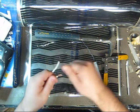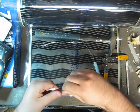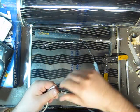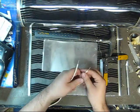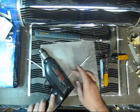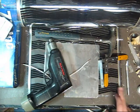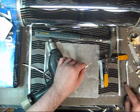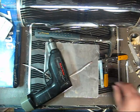I like to just twist it up like this so it all stays together. Something else I like to do is put some solder on these ends already, so once I put it down onto this part it'll stick right away. I'll put some solder on here, and then I just press the soldering iron and it's a lot easier.